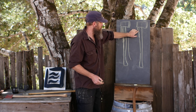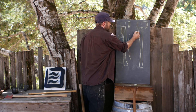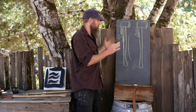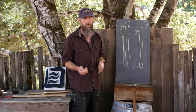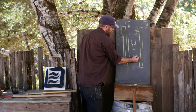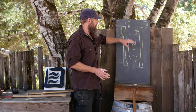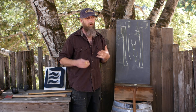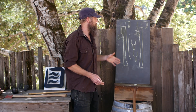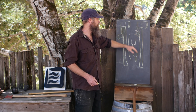In a well-designed axe, the handle comes out with a gradual taper, and yes — there's still going to be a high point of stress somewhere in there, but we distribute it out along that curve. I knew this by intuition and from using tools, but if you look it up, engineering confirms exactly this: if you're making a metal part and there's a sharp shoulder, that's weak; but if you put even a small curve there it makes it much stronger. The longer and more gradual you make the transition, the less stress stacks up — up to a point. Is this a fix for the whole problem? No. It's still inherently a problem; it's just less of a problem.